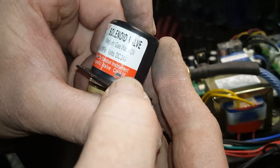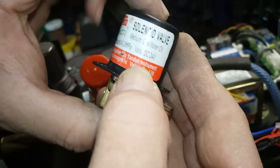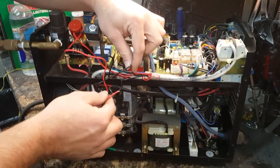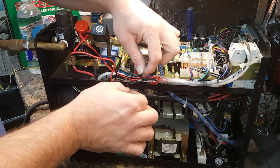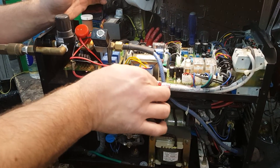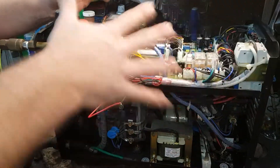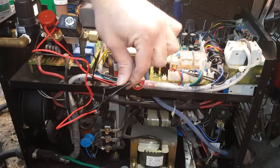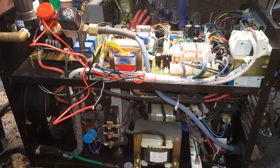What happened was I tested these two wires right here with my voltmeter, and I found that every time I pulled the trigger and turned the machine on, it would get 20 or 30 volts. So I knew the computer was working. There's a relay right here that turns the air valve on and off. I knew this was getting power, but my solenoid was not working.